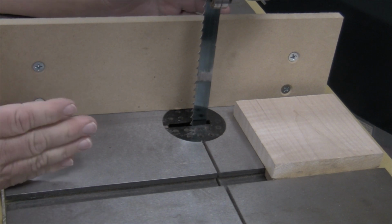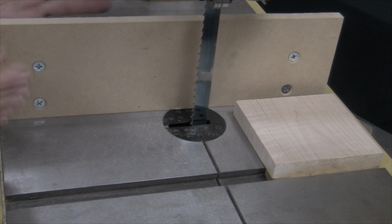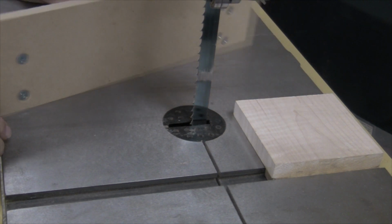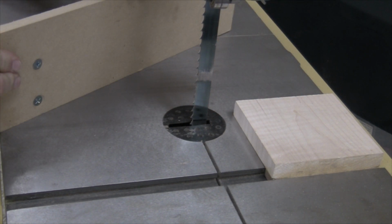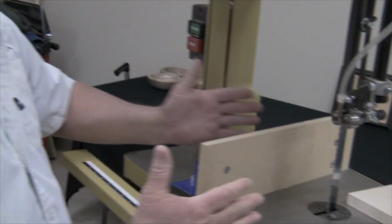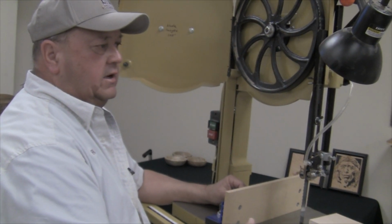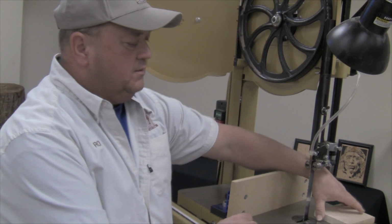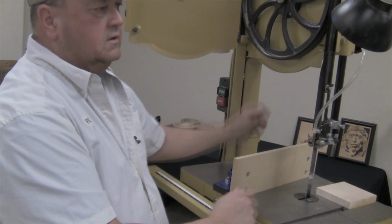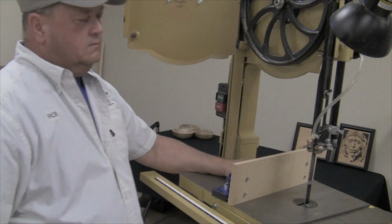And if you did a certain cut over and over again, which I did this for a bandsaw or something at one time that I wanted to cut off exactly a 1/4 inch, you can put it like that. So you have to make sure you do it in consideration that you're going to be using this board on here and whatever you're doing. And you can make 3 or 4 of those. If you had a habit of making little boxes that you were passing out to people, and you did a 1/2 inch cut in different ones and wanted to line it up, if you're using this type of fence, just make something like this. You put it on and cut it to the size you want, and after that, you have no problem.